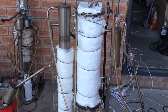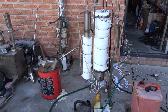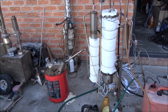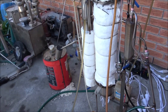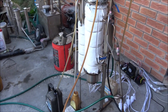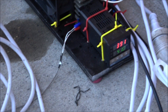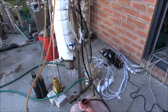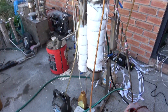You can hear there's some water droplet explosions because before yesterday I was distilling some good transmission fluid. Today, to test the unit, I collected all the oils and whatever leftovers I had — and of course there's some water in there. Currently running at 390-392°C with the temperature control set at 410 degrees Celsius.